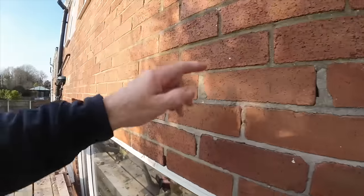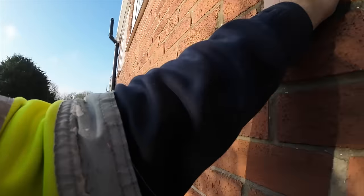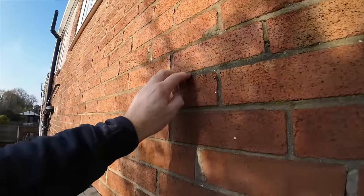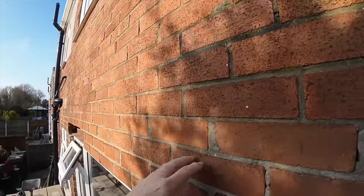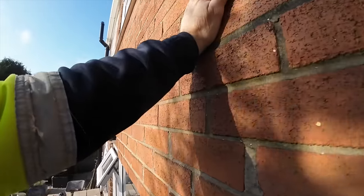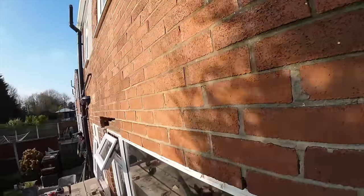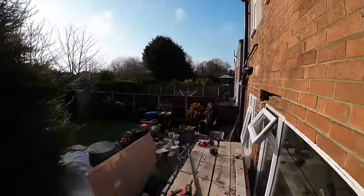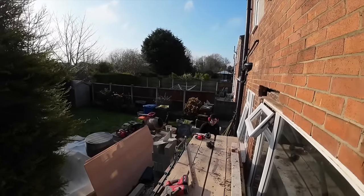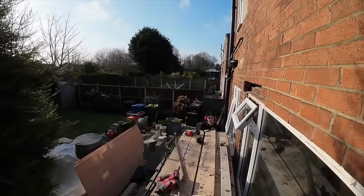Yeah, that's the plan. Putting our first acro in now, but this brickwork, it's absolutely solid. There's no cracks in it, no movement. It's tough mortar, so the bricks aren't going to drop. We could theoretically take that whole lot out and support ourselves because it's that strong. As always, we put the acro in just to be safe. Because we love working around acros, don't we, Al?